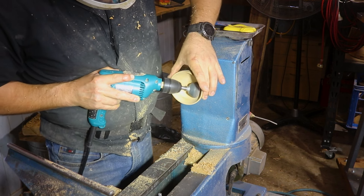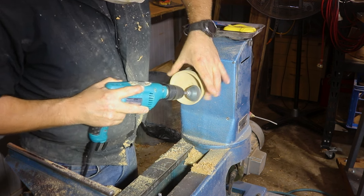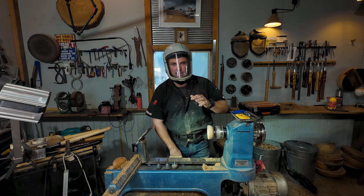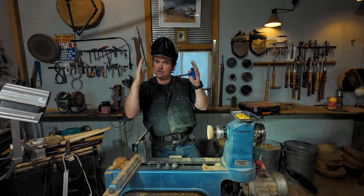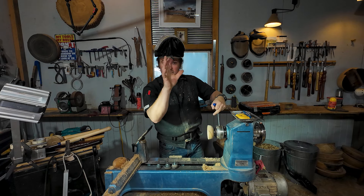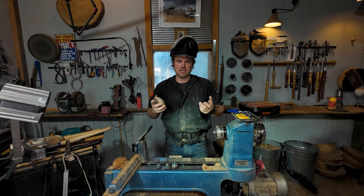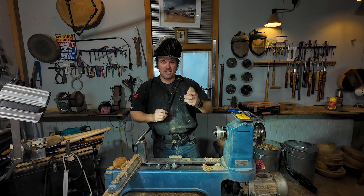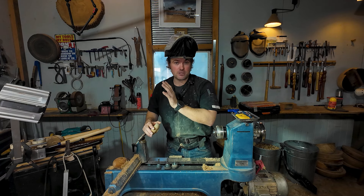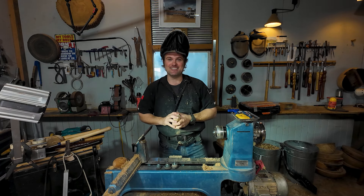As the lathe is running I just lightly touch it like so. What that does is it maintains the strength on the outside of the bowl so it's not moving in and out with the speed of the lathe. I'm not forcing that sander head in where it could push the circumference out and change the shape of the rim, leaving divots or one side really thin and the other chunky. That way I can keep a nice even width of rim all the way around. It's so awesome to be back - thank you so much for your patience. Check out that sanding video and the video about using the friction polish method. Thank you all so much, cheers!